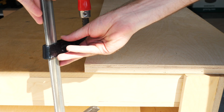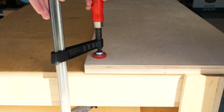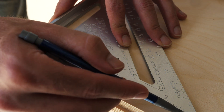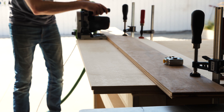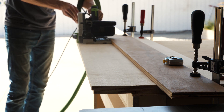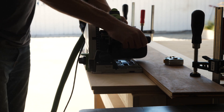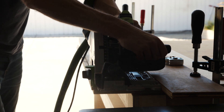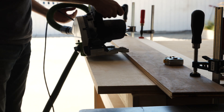In this type of building, consistency is much more important than accuracy, so that's why you see me here clamping pieces together. Basically if you need a top and bottom and you're going to use a circular saw, try to cut them at the same time so that they're identical. That eliminates 90% of the problems that human error can cause right off the bat. Here for a straight edge, I'm just using a long piece of plywood that I had lying around. I always keep this piece around for this specific purpose, so this is the most affordable method you could use.